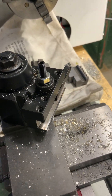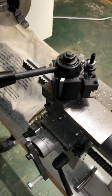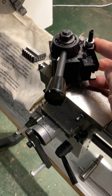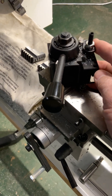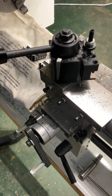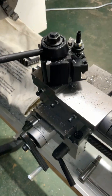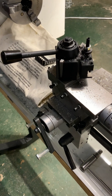Right now I've got a quarter inch cutter, but I have 3/8 on order. You just loosen the handle up here and turn this dial to adjust the height — whether you want to be in the center, a little lower, depends on what you're doing. When you move the handle, it pushes this wedge down and really locks it in there tight. To spin the holder around, you just loosen this nut with a wrench. It's a much better system than what they provide.